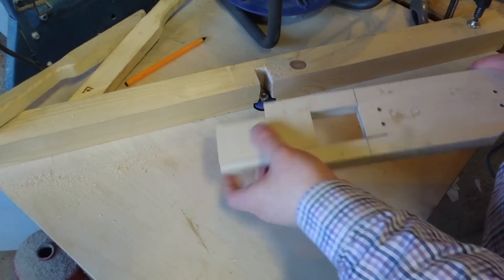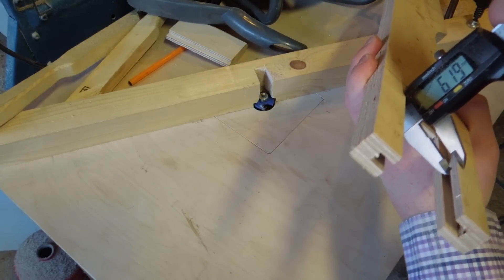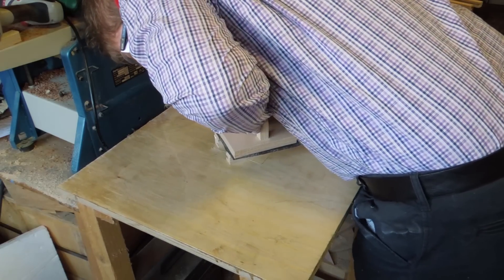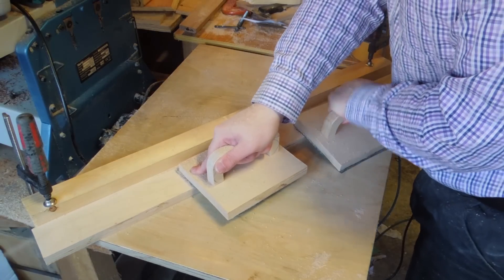Although right away I ran into a problem. Turned out the router had cut a tapered groove into the sides — turns out this plywood wasn't flat either. So I cut the grooves a little wider using some push blocks to make sure the wood was flat against the table. After some fiddling to get the cut right I routed the tongue into a long strip.